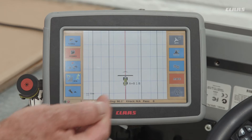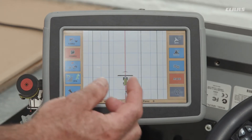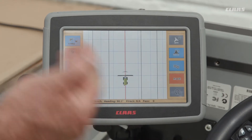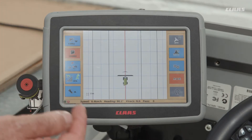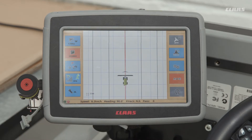Your machine would have been set up with the width of your cutter bar so that your A-B lines are set all the way across. If you're running with RTK, these lines won't physically move, but if you're using one of the satellite correction signals, this will drift as you go through the day.